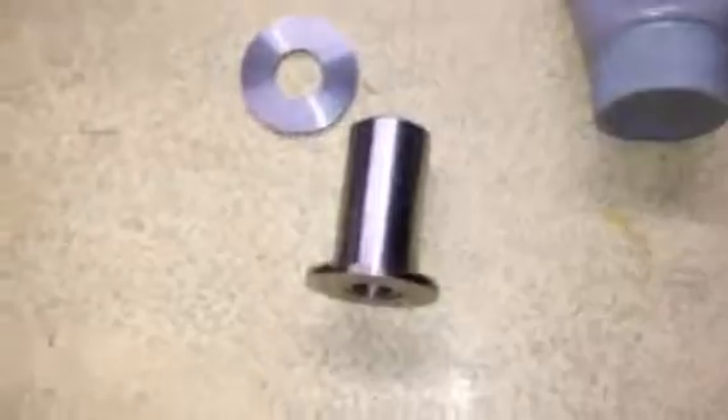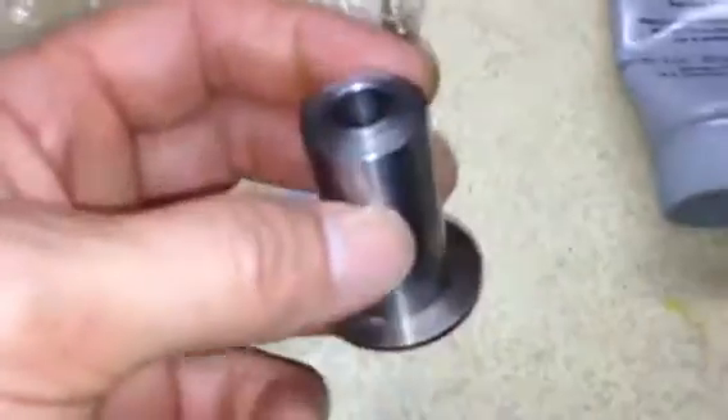So here's the pivot bushing I'm talking about for the belt tensioner — this is what I've been talking about the whole time, what I'm talking about greasing. This one's made out of stainless steel and it's made by Anton in Russia. It's excellent quality. He supplies a grease fitting with it — also known as a Zerk fitting. If you go to his webpage, Anton is not hard to find. He suggests drilling right into the outside of it so grease gets in. He makes these bushings out of stainless and they're really nice. I will put it in one day, but I've only got not many hours since I've already greased my pivot bushing.